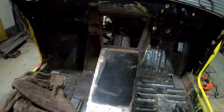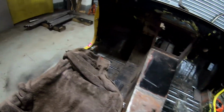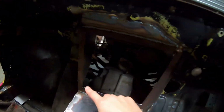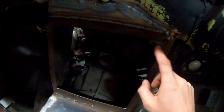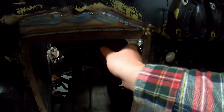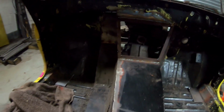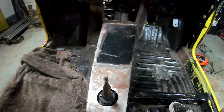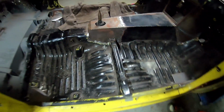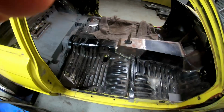And then I've just extended the coffin, what was dubbed the coffin, my boxy gearbox tunnel. It's got a slight little curve to it, but ain't we all? Again, this is going to be that access panel I spoke about ages ago, with loads of nice little Allen keys with the machined washers. Then I can get to the cam angle sensor and the rear water outlet. It took a bit of time to cut and make all these panels, so I'm going to try and buzz all this up today, because I don't want to be leaning in there with the door bars tacked in. So while it's free, I'm going to do that.